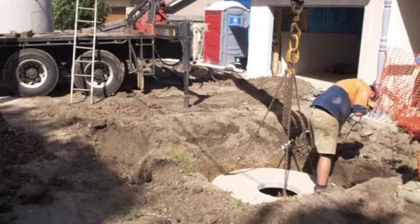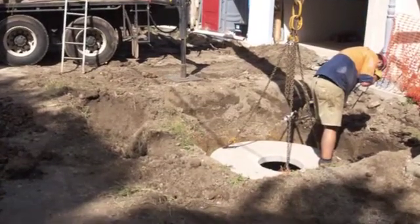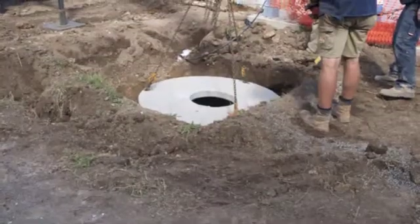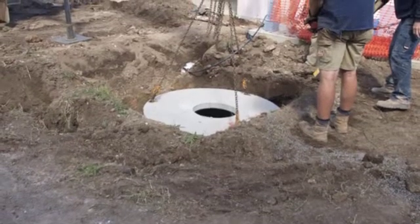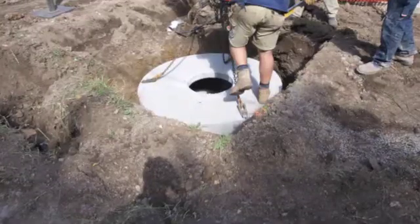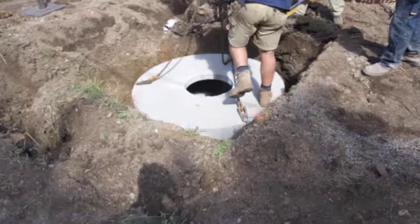As you can see we use the crane truck here to drop them straight into the hole. You can see the manhole in the top there if you do need to get access to that filter or the sump pump that's inside the tank. We just backfilled with clay and other sticky material rather than crushed rock or sandy material, which would allow too much water to get close to the side of the tank and risk it floating.